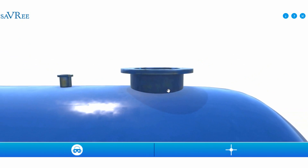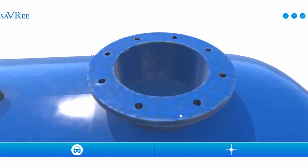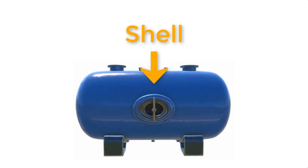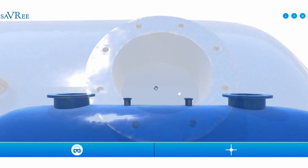In order to install a pipe, we have to cut a piece of metal out of the main shell. The shell is the exterior parts of the pressure vessel itself, which includes the round ends — often referred to as dishes — and the longitudinal cylinder which joins the two ends together. All of that is referred to as the shell.